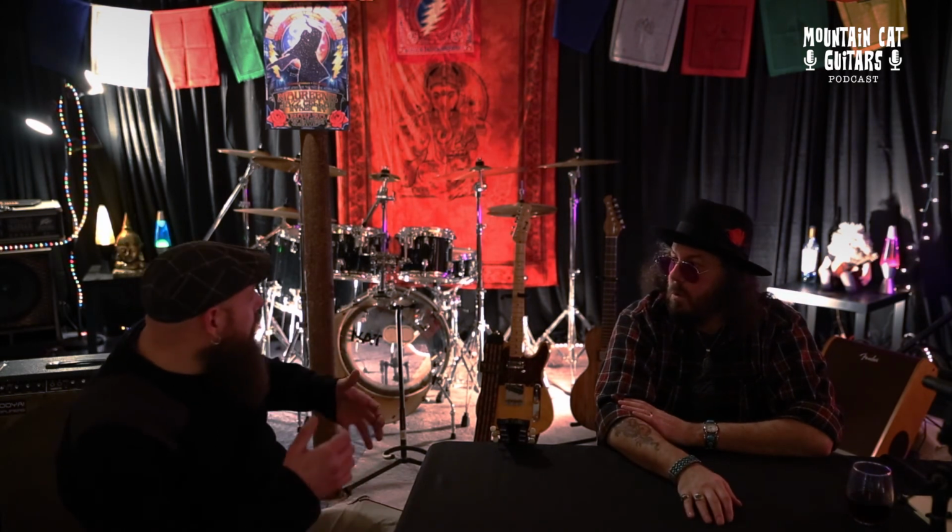I was working on a V4 Ampeg, and I discharged all the caps. But the problem with the amplifier, unbeknownst to me at the time, was that this spot weld inside the can cap had broken. I was going to recap the amplifier anyway, so I took all the voltage out of it. And man, did I get bit when I was wiggling that can cap out of there. I had my hand on the other side of the chassis. It knocked my ass out cold.